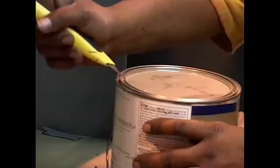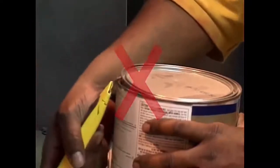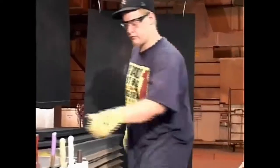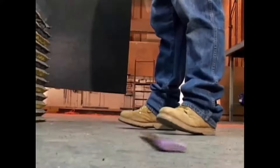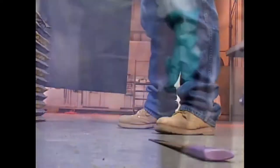Simply following good housekeeping practices can prevent many knife injuries. Allowing an exposed blade to get mixed into a toolbox or other storage area is an accident waiting to happen. Only use a knife for its intended purpose — never as a pry tool or screwdriver. Should you happen to drop a knife, never attempt to catch it. It's better to let it hit the floor than risk grabbing the blade. For this reason, fully enclosed leather boots or shoes are recommended when working with knives. If you must travel while holding a fixed blade knife, keep the tip pointed down and walk carefully. Stay alert for co-workers who may be in your travel path.